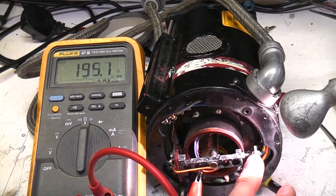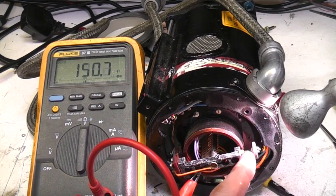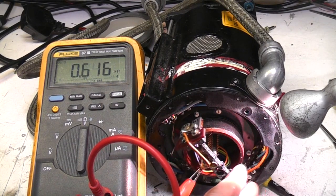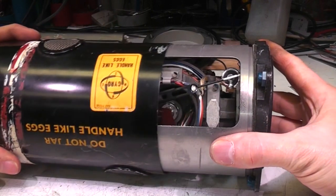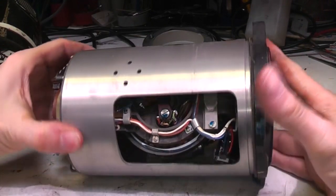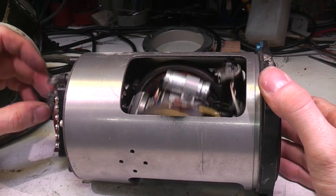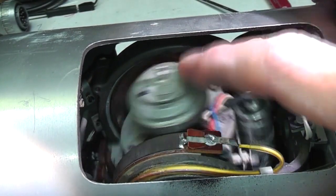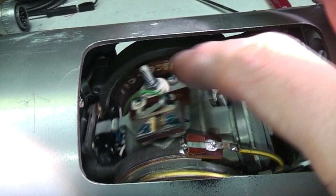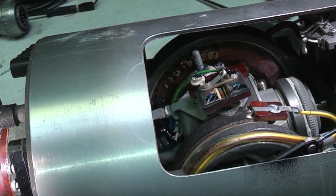This screw adjustment here, I think that's almost certainly just balance. It doesn't really go anywhere, so it's just adjusting the position of this weight to make sure this thing has no natural position. Wow, amazing bit of electromechanics in here. This again, super smooth, super fine moving internal piece. And again we've got another one of these rotary pots here.